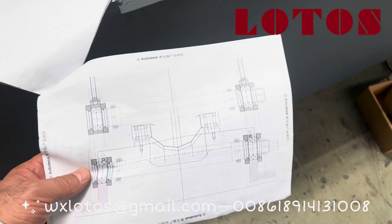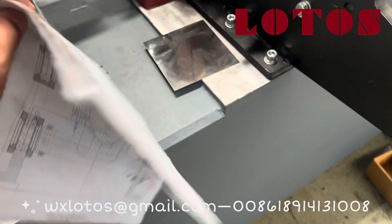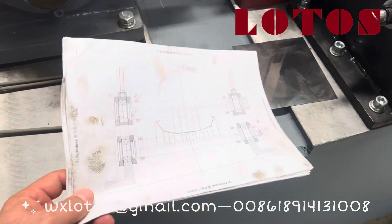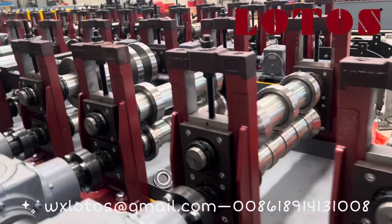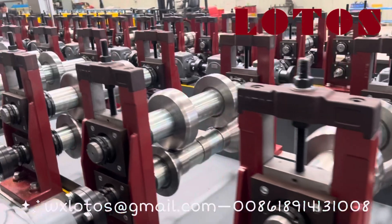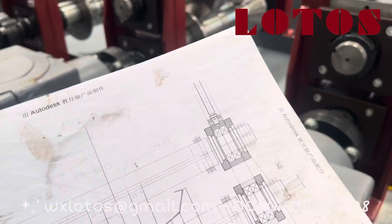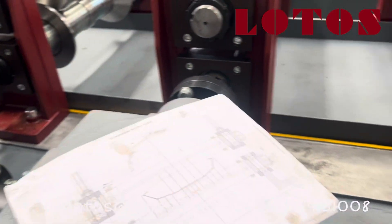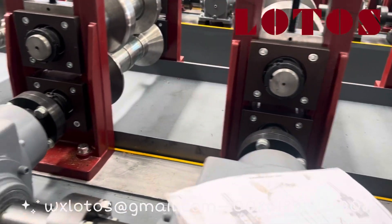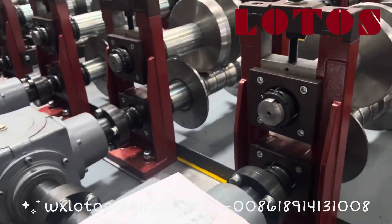As you can see, the final shape should be like this — 19 stations. Here from station 11 onwards, I'll show you the second half, because in the first part different roller separators are already installed. I want to compare from station 11 to the end: one, two, three, four, five, six, seven, eight, nine, ten, eleven. From here, let me go up and I will show you and compare the drawing and installation for you.